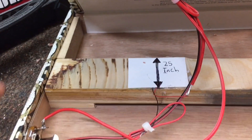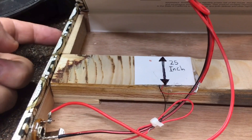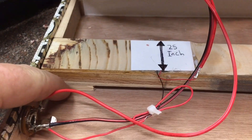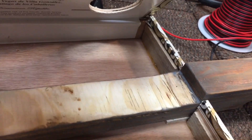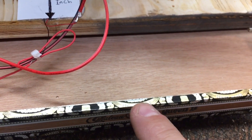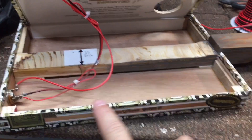A couple of things to point out: the extra internal bracing there, and that's so I can screw in a strap button. Blocks underneath. Here, extra internal bracing along the edges — that's just to give it some strength. And then of course these blocks here to screw the top down. I will probably do another screw right here in the middle just because of this long span right here.